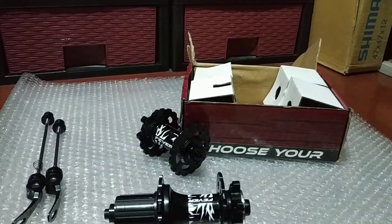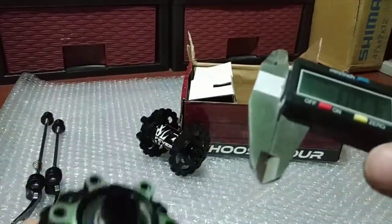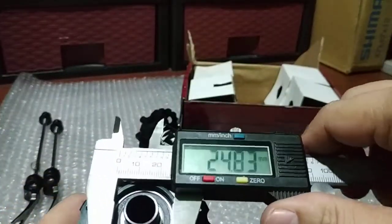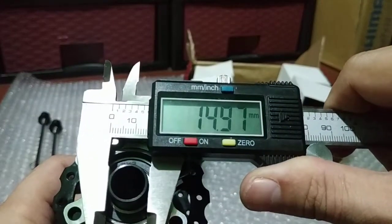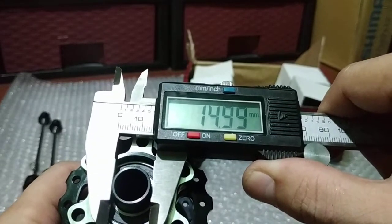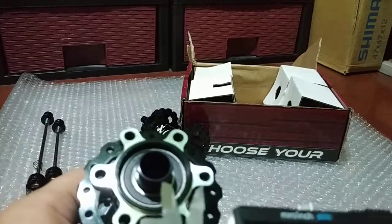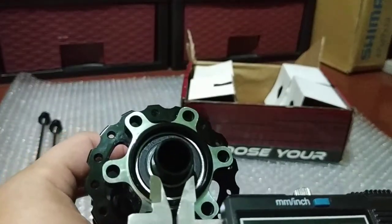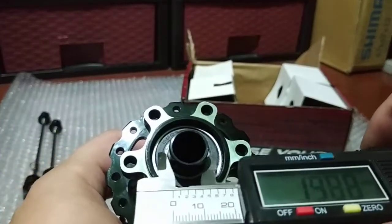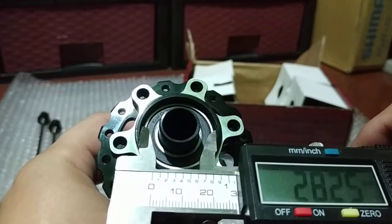To confirm the axle size, I'll use the digital caliper. Let me calibrate to zero and check the inner diameter. I'm guessing this is 15 — yes, 15! That's good news because if the ID were 16 it would be much harder to find bearings. Now let's check the outer diameter — I'm guessing 28 since it's a 6902. Yes, 28 indeed.